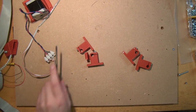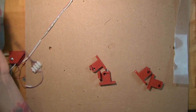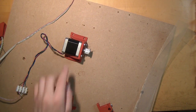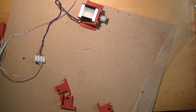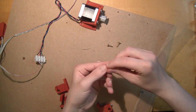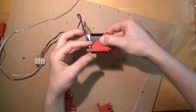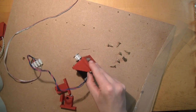What we do next is we're going to screw all of the stuff to the base plate. Let's start with our y-motor. You have to locate four holes that are pretty close together — that is where your motor comes. Now take your wood screws. You want star washer, M4 washer, and then just screw it in here. It's easier when you put all the screws in here to begin with, then it's easier to screw it in.